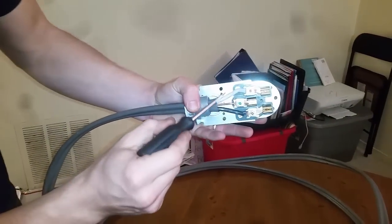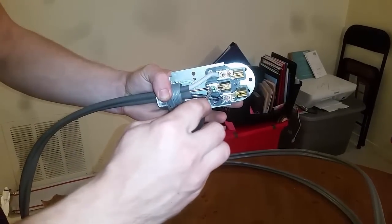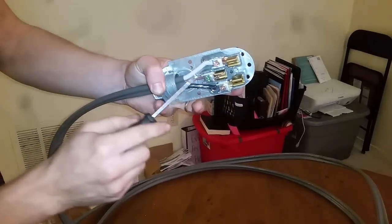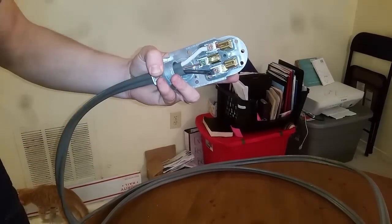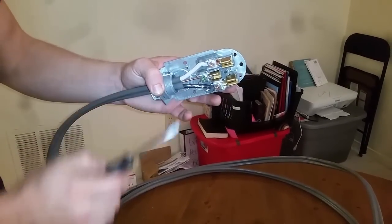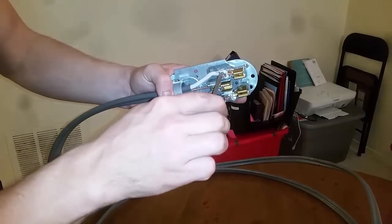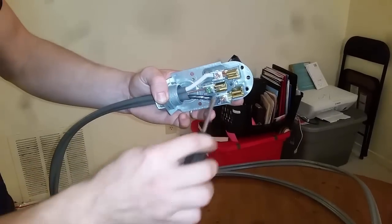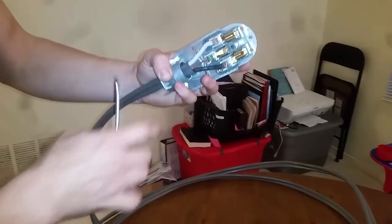This is how you wire it up. The bare wire is a ground — it'll be marked with a green screw, and 100% of the time I've ever seen it, it's always marked with a green screw. So the bare wire goes to the ground and you tighten it down. The left and right, the white and black, it doesn't matter which one you use. They're both 110 volt legs and they go to one side or the other. Tighten them down after you strip a little bit of wire. Once you wire it all up, make sure it's tight so there's no continuity loss.